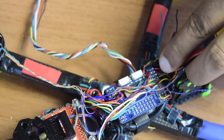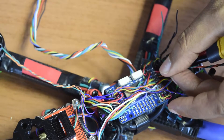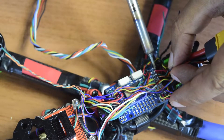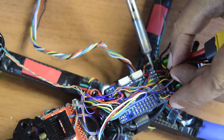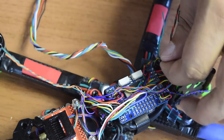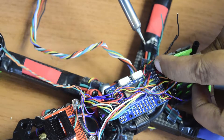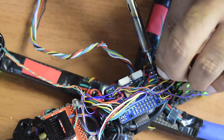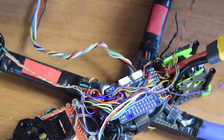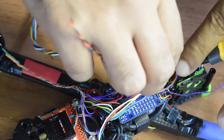The RX pin is connected. Now let's connect 5V — this is the 4V5 pad, which gets powered up directly when you connect the USB. This means when you are configuring the receiver module using the configurator, you don't need to connect the battery, which is a nice feature of this flight controller. The 5V pin is soldered, and now the last one — the ground — is soldered as well.